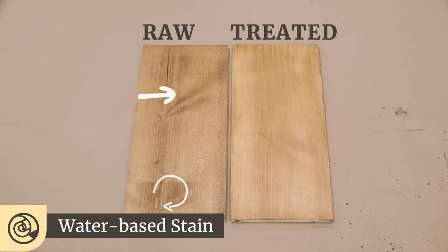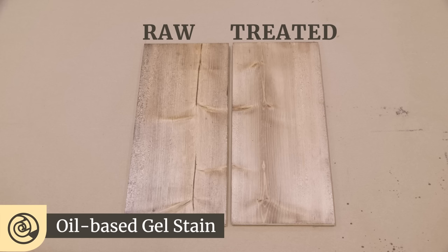Because of the way those lines run, I'm actually going to say that's probably a flaw in our sanding. Also notice that the right board is upside down — because we're not very smart. The oil-based gel stain kind of surprised me. Normally gel stains are the ideal solution for blotch-prone woods as they really don't absorb as deep as typical stains. But I don't really see a huge difference between these two boards. If you look closely, you can see more dark embedded color that looks a little dirty on the left-hand side of the untreated board, and you might also notice two dark streaks which actually appear as light streaks on the treated board.